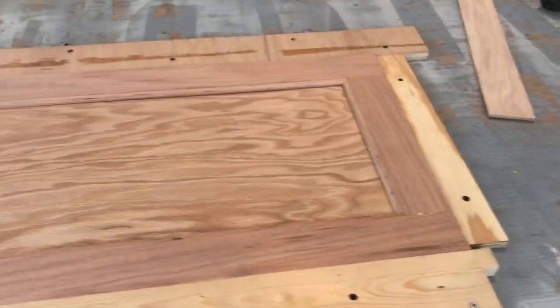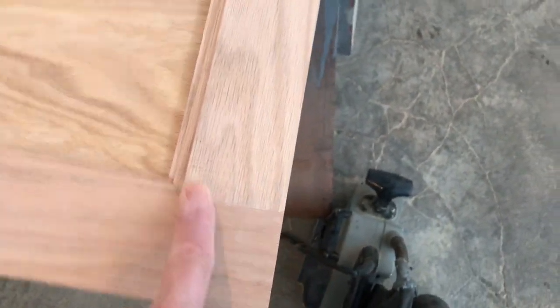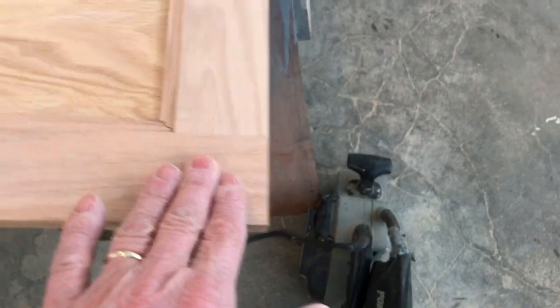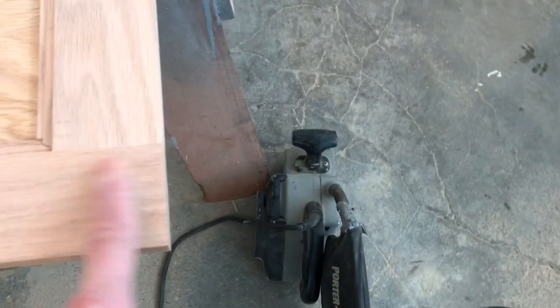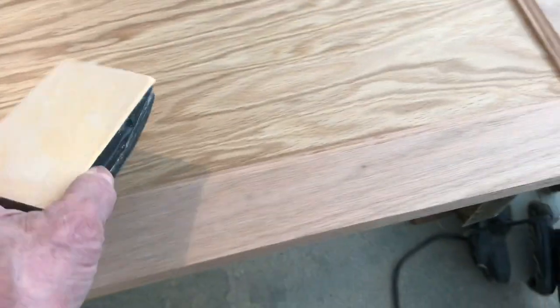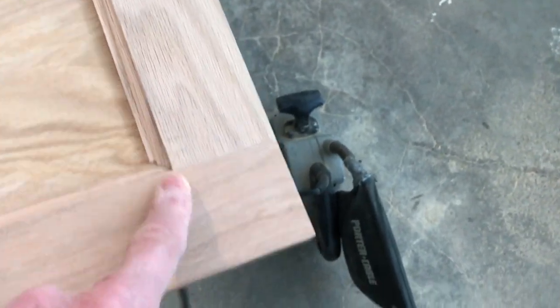I've got another door in the glue jig right now. The first door that I popped out, I started to clean it up a little bit. I did use a belt sander to dress up these joints — you've got to be pretty careful because as you sand across this, you're going to put marks across the grain. So I sanded this one first and then this one, and then came back and got it with a belt sander, wiping out any cross-grain sanding marks as well. I took a sanding block and gently knocked off the sharp edges — any place you've got a sharp edge on wood, you're just setting it up for failure.